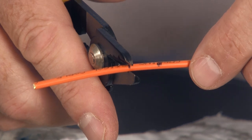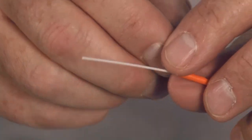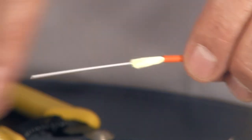I've got a tri-hole stripping tool that strips off jacket, primary buffer, and secondary buffer. I'm going to use the jacket strip on the first mark — you just crimp and pull and it comes off. I'll separate my strength members from the actual fiber itself, then take a pair of special scissors to cut Kevlar and strip off the Kevlar strength members. Then I'll strip the jacket again at the second notch I made.